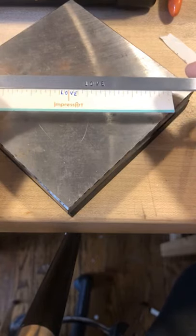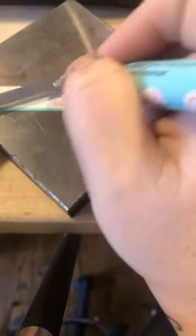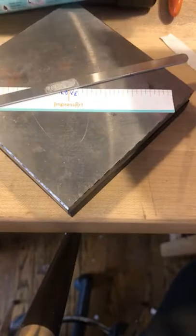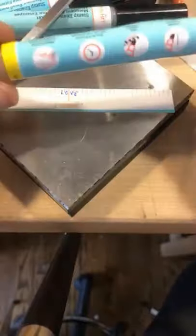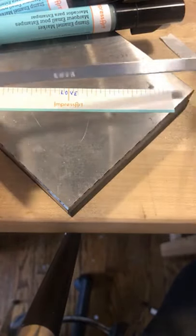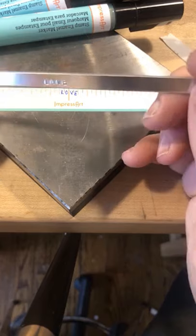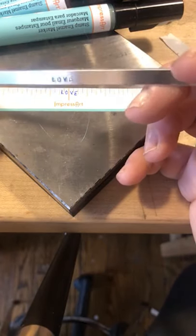Some people on aluminum like more of a muted black. How I like to change that up is I take my silver marker — this is available in a pack of a few markers. This color also comes in a nice brown like a chocolate brown, a nice patina green-blue, and a metal flake gold. I'm using the metal flake silver. You're going to dab it and lightly wipe, and you'll see it's more of a gunmetal gray — not so stark black. That's the mixing of those markers.